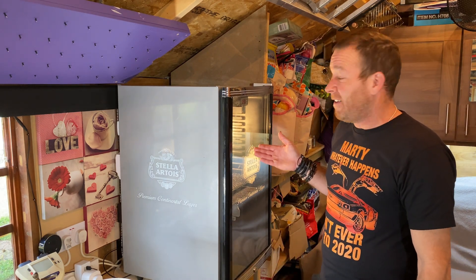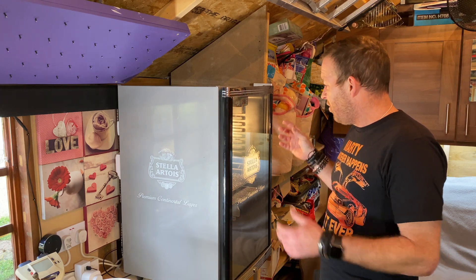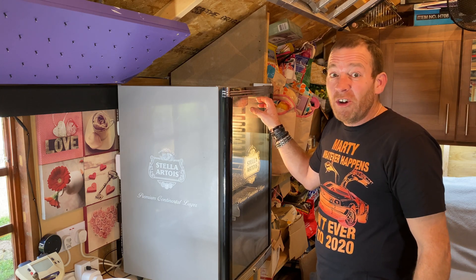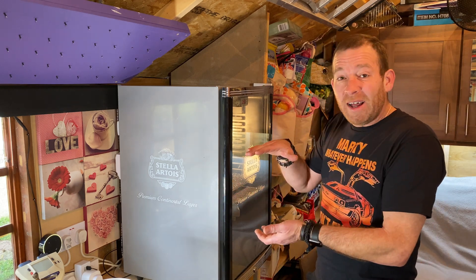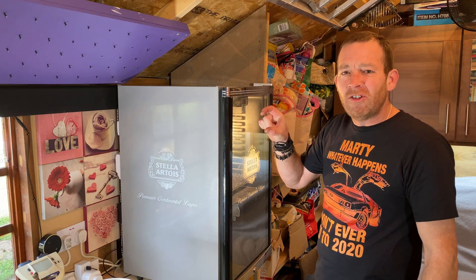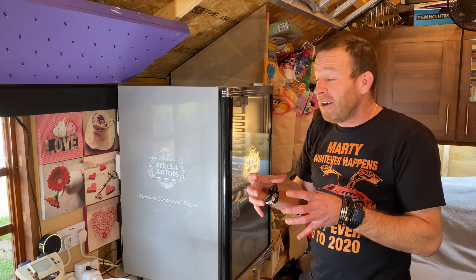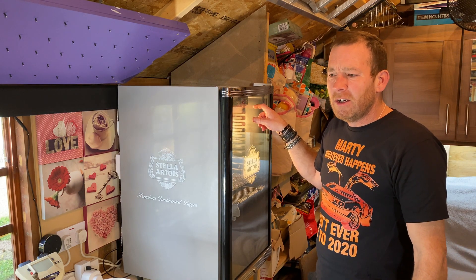It's been set running for about three hours untouched. I'm now going to do one final thing I did last year with my incubator: the ice water test. Get a glass full of ice, fill it up with water, drop the probe in at least an inch or two inside, making sure it's not touching the outside of the glass. It should read zero degrees because water freezes at zero.